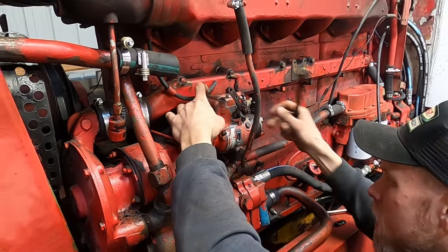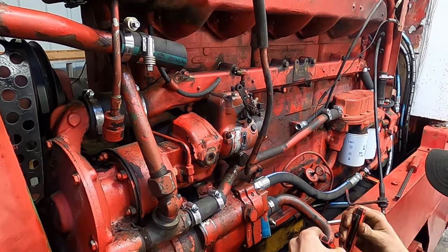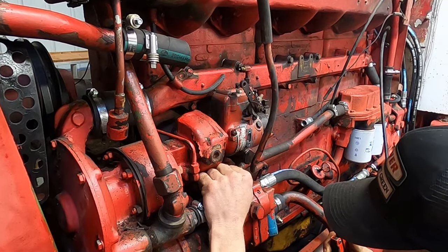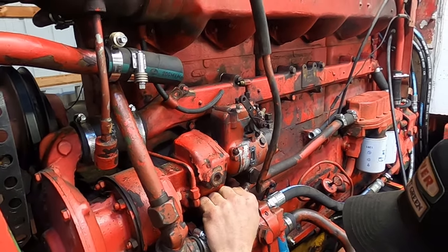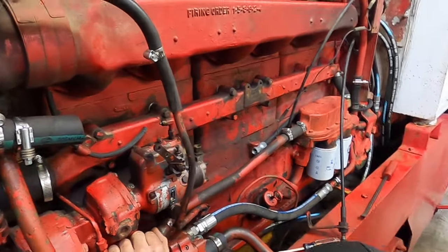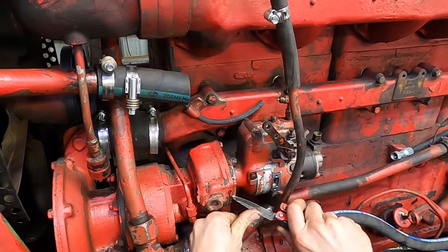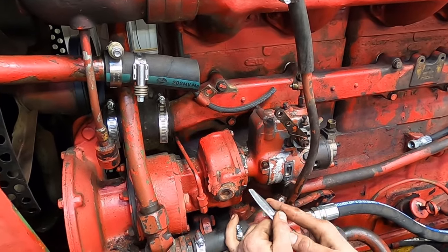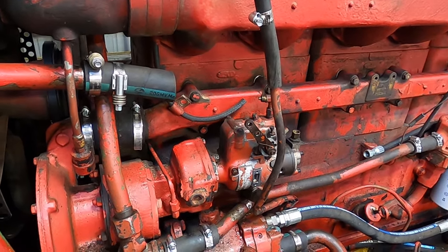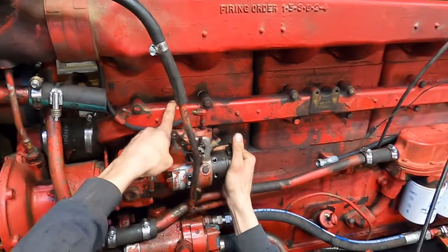Phil also brought me back the alternator. He had to basically rebuild it. Said what? Bearings, rectifier. Yeah, all new bearings, front housing, rectifier, diode trio, brush holder, and regulator. Sitting outside for the last 15 years or whatever didn't do it any favors, obviously. No, it didn't.